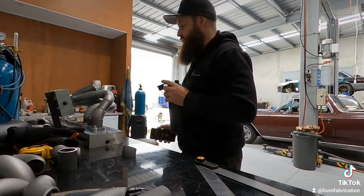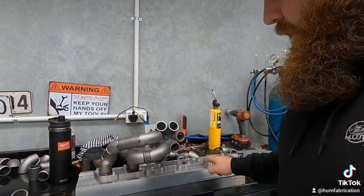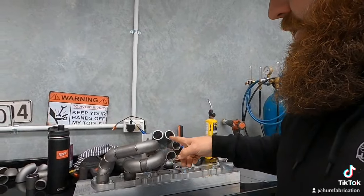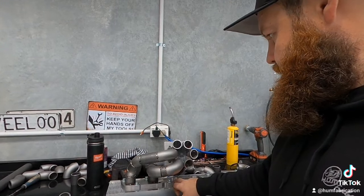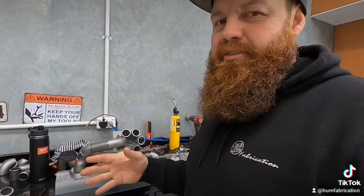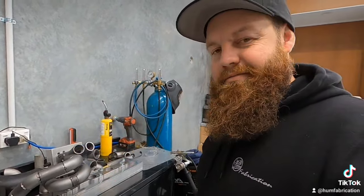Camera died, so hopefully that saved enough. We're back though — into making number six. The idea is we've got one, and then we're going to have our firing order going into our opposites. It's only going to be two and four that are arse about face. Otherwise I'd have to cross that one to there, and then bring four up and around and into here, which is a bit of a major, really. Everything goes boom boom boom, and bringing number six down low is going to make downpipe room better. Not too shabby.